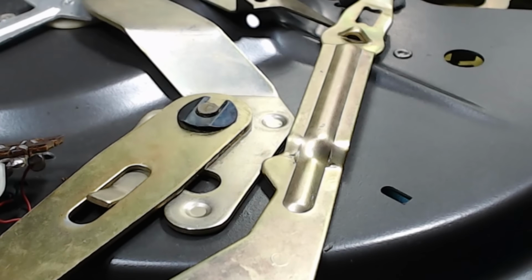I've skipped ahead a little bit. I've put the back shell on, I guess you call it, mounted the cartridge, soldered the wires on, and yes, they are soldered on. There's no provision to clip them on as you normally would. I resprayed this silver bit here. This is metal. It was corroded, so I sanded it all back, got the corrosion out, painted with some silver paint.